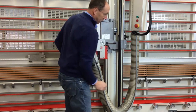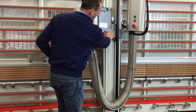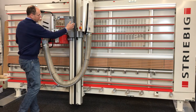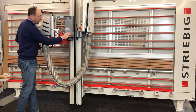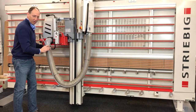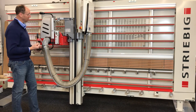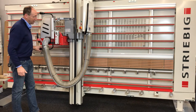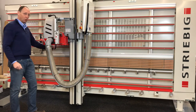With my pointer fingers on the tape scale, I simply move the saw head into position and lock my saw head with the kip handle. It has a similar safety to the tall locking bar for vertical cuts — if I don't lock the saw head, or don't lock it fully, there's a little device that prevents the saw head from going all the way in. It'll go part way into the panel, but you'll notice very quickly that you're not making a full separation. When you twist the handle completely to the right to its full lock position, the saw head is able to bypass that slide piece and go to a full depth plunge.